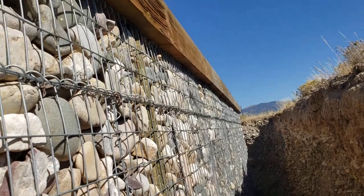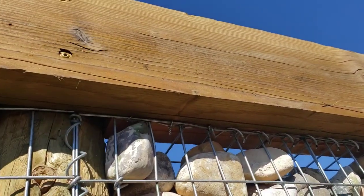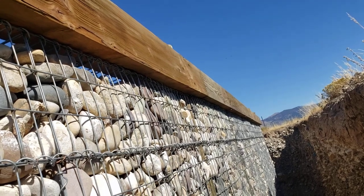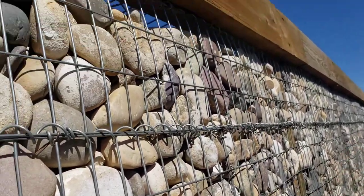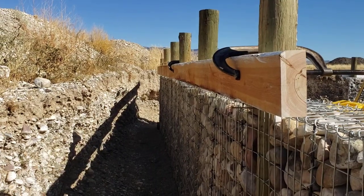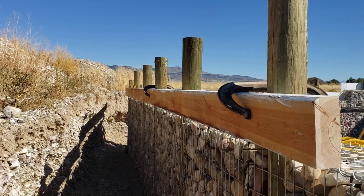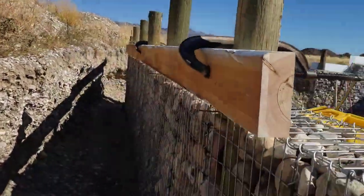This is a good perspective inside the trench here. You can see the outside timber, which is attached to those posts. I went ahead and painted a pressure treatment on it because that is what we're going to be backfilling the ground with. So you want to prevent any rot or anything going on right there. It's pressure treated — you can buy a 25-year or something like that. On the outside here we're applying the pond liner, and any backfill that touches that wood will be pressure treated. The stringer timbers are about two and a half to three inches thick, so we've got plenty of support to tie these posts, these gabion walls. It's white on the inside and pressure treated on the outside.